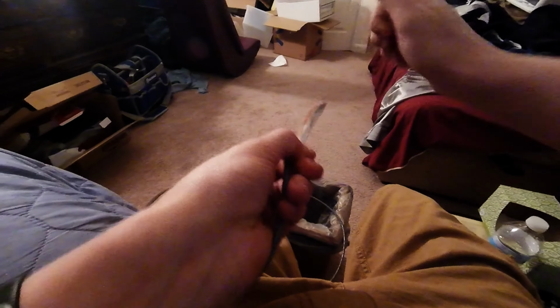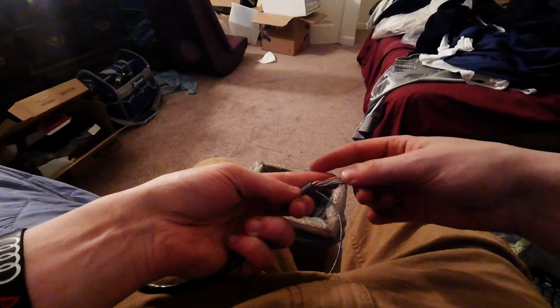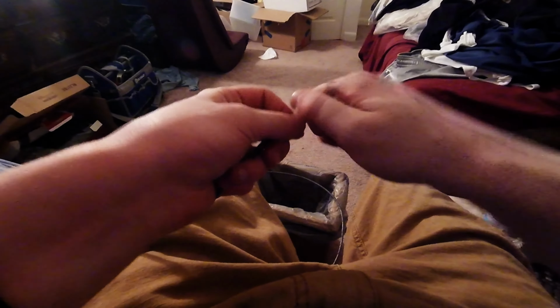And I always go like this with them to really get them in shape. And then you want about a thumbnail length, so about one finger. I guess that's hard to tell because of your fingers, but I usually do about a thumbnail. And you always want to check your order again, so it's white orange, orange, white green, solid blue, stripe blue, solid green, white brown, brown.